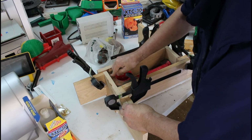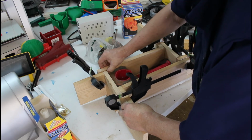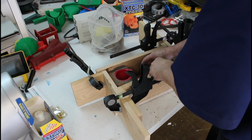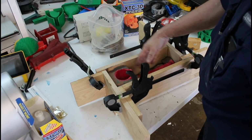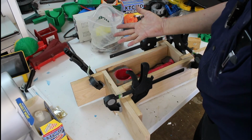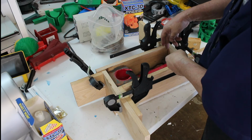With the head pretty well supported now, we can move back to the body of the handle along its length, and start building it up. So now you get an idea of what I'm talking about. We'll build this as a wall and bring this up halfway up the handle, and then pour this full for half the mold, and then we'll unmold that, turn it upside down, and fill the top half. And that gives us a parting line that will operate with the draft on the head, and the handle will still be able to come out.